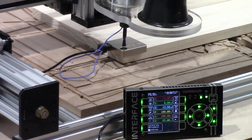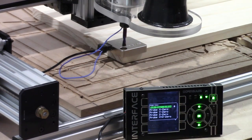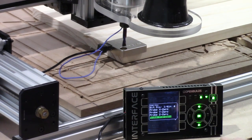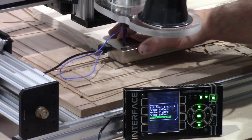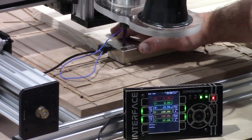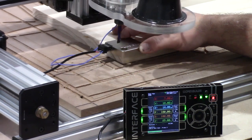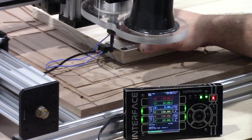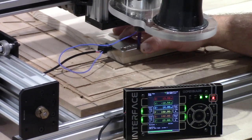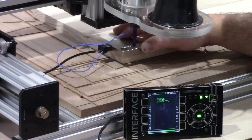At this point we're ready to run the probing utility. Click on Tools and Utility, then click on Probe. Scroll down because we want Probe XYZ0 — this will make our starting point. If your probe has a tendency to wiggle around a little bit, you may want to hold it in place with a couple of fingers while it does the probing. Go ahead and hit OK. It's going to do the Z first from the top down — found the Z. Then it comes over to do the X from the side. It'll come out to the front in the middle and come back to do the Y axis. Probing is complete.